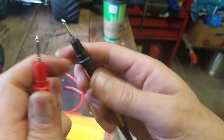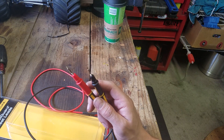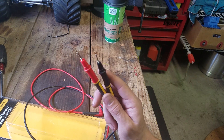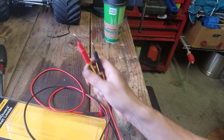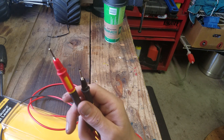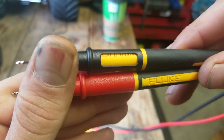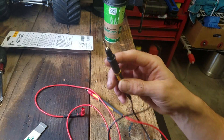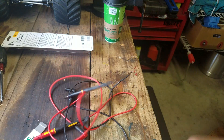Don't cheap out on test leads. You could have a $10,000 tester and $15 leads, and you basically have a $15 tester. The tester's only as good as the leads, and I never really put a second thought into the leads until I bought shitty ones. So if you have Fluke testers or use testing equipment in a professional environment, get leads that match your meter — spend the extra money. These are like $35 and worth every penny. I'm going to get at least two years out of them, if not more, if I take good care of them. And I'll tell you what, when these wear out, I'm buying another pair right away. The Fluke TL-175 test leads — they're the twist guard — and they fit all the screw-on Fluke accessories. Good length, good feeling, good connection. This is a lead that you can have confidence in. That's it till next time, thanks for watching.